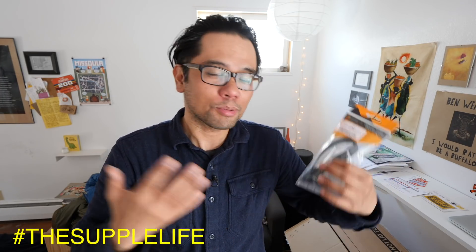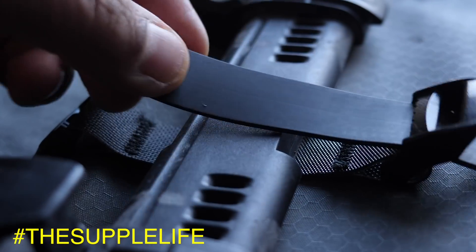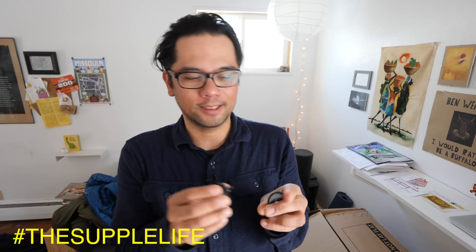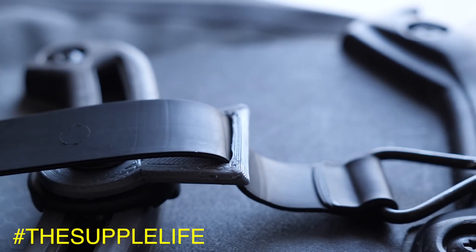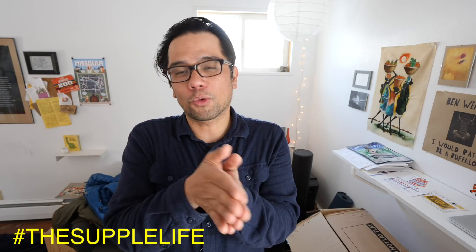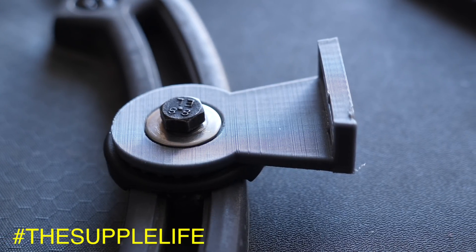So when I got home, I took the elastic bungee system and attached it to the Ortlieb, which is pretty straightforward. I'm not going to do a full tutorial, but you remove the bolt, slip the piece in, and put the bolt back in — and that gave us the bungee part of this bungee system. After that, I replaced the plastic bits I was redesigning and it actually fit. Some things were a little bit rough. With version one, the path of the elastic was not ideal because it was having to go across and into, and then come back out, causing all this binding and friction. So seeing that, I immediately just tweaked the design. I changed the orientation of the slot so it was more of a pass-through, and the anchor system was acting as a guide rather than physically pinning it down to the bottom of the bag. And it works awesome.